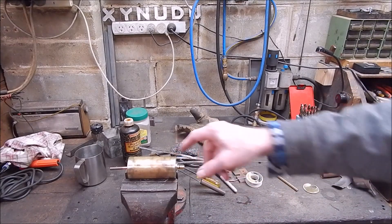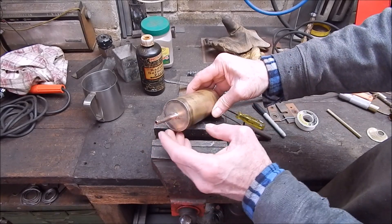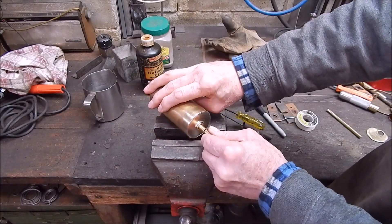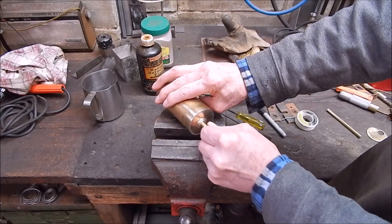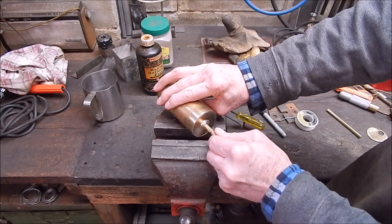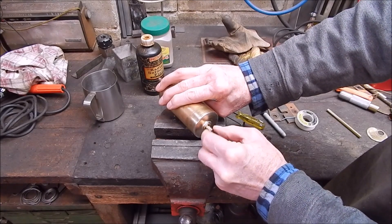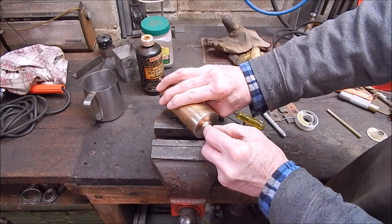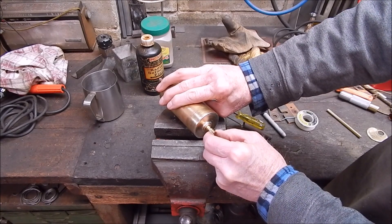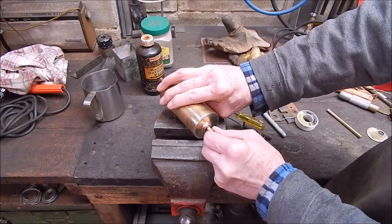So I've come in close on the boiler — here it is, made out of brass. That's the feed pipe going in for the cylinder, which is on this end. That's the piston. It's going to have a 20mm stroke, approximately. So I've cut that to length. The next job will be to put a slot on the end for the conrod to go in. I'll mill that on the Chinese lathe using the little 775-powered milling, grinding, drilling gadget I made up years ago.